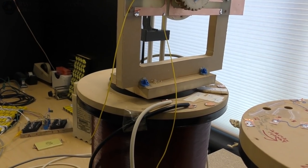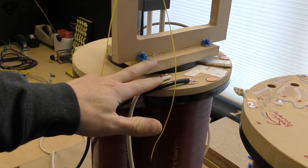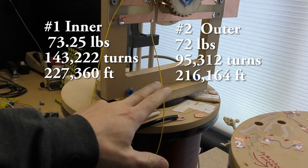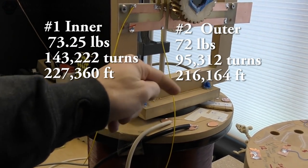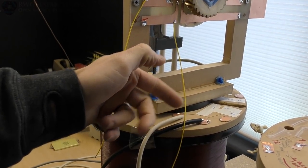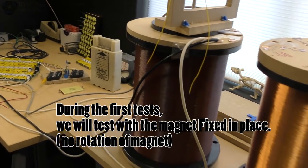When we're doing these tests, we're going to use this coil here. This coil has the exact same amount of wire on the inside as it does on the outside. There's actually three coils. The outside only has about 2,500 turns. The inner two — I forgot the turn count, but they're quite high. The inside has more turn counts than the outside one, but these two are equal lengths of wire.